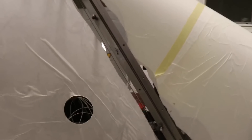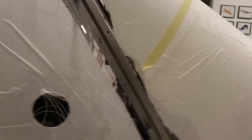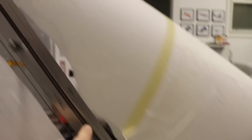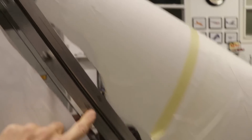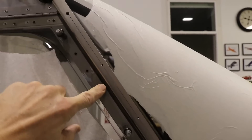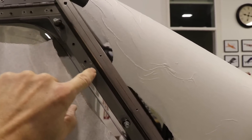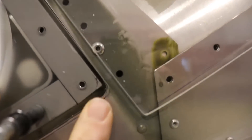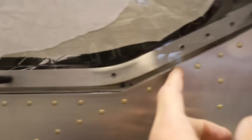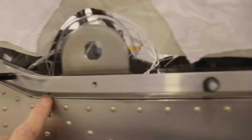Let's see how we did on the first cut — some of this might be hard to see on camera. Even though the door is cut perfectly straight, it's a little bit closer to the trim up here than in the middle, which tells me this trim piece isn't perfectly straight. I'll probably just sand a little bit there. Down in the corner I need to round it off a bit more, and all around the bottom it's almost perfect — maybe just a 32nd of an inch or so to take off.